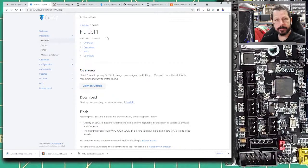The deal with using Octoprint is that you couldn't use one of the lower level Raspberry Pis. Now I've got this on the same Raspberry Pi that we had before, so it's the 3B Plus, but technically you could run on one of the zeros, but Octoprint won't run on one of the zeros, or it will not run well on one of the Pi zeros. So they're cheaper, and you can do this with that, but if you're running one of the Pi zeros, you pretty much have to use one of the front ends that's made for Klipper, not the Octoprint front end or interface.